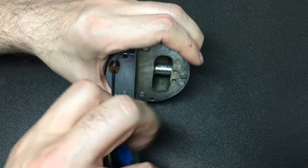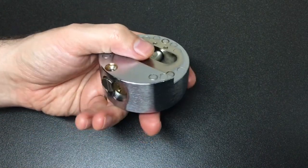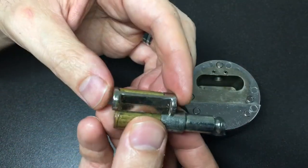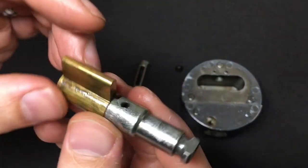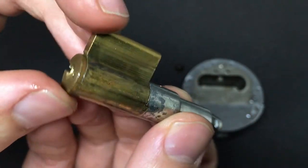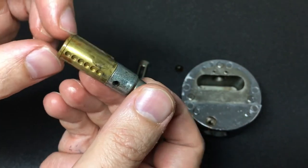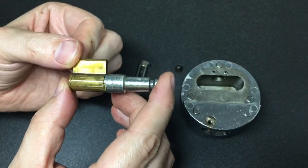You can undo this little screw, which is weirdly rusted compared to the rest of the lock. Because it's open, we should be able to pull the whole core out, put the body aside, and take this little spacer off the top — it's a bit like a little Kwikset cylinder. Oh my goodness, is that greasy — look at that! Then you've got that little split roll pin there, which you could punch out, but getting it back in I'm not confident, and I quite like this lock so I'm going to keep it as is. The only other odd thing about this lock, as I said earlier, is it's pinned to six when a lot of American locks are standard pinned to five. I hope you enjoyed it and I'll see you all next time.